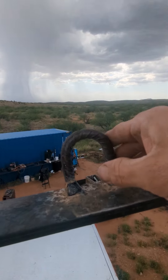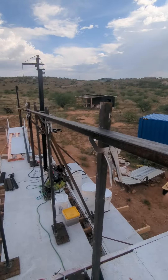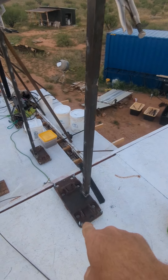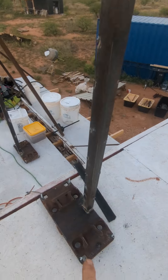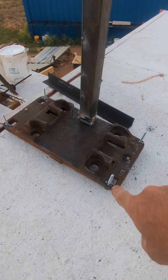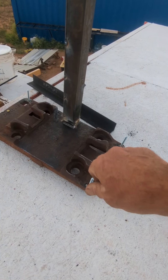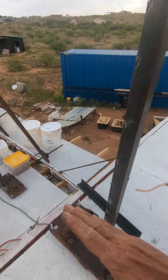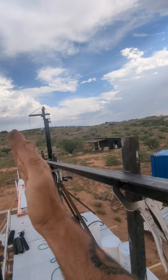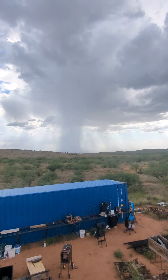I had to weld on a piece of rebar loop here for my hoist so I could pull this one up. It's in place and anchored to all these different spots. I had to fabricate all of these — they're adjustable at the base. These are railroad tie plates, and what I did is take carriage bolts, made a hole, put a nut in there, and made it adjustable so I can keep this part level. So when I'm doing my truss, it stays level.